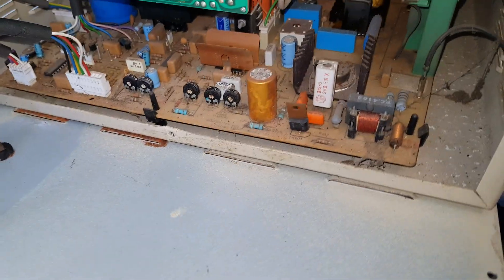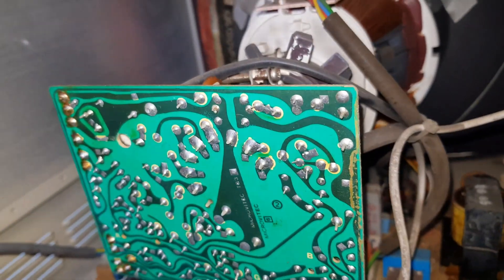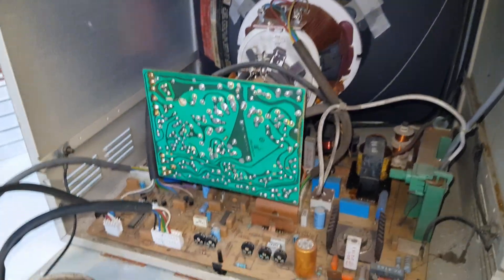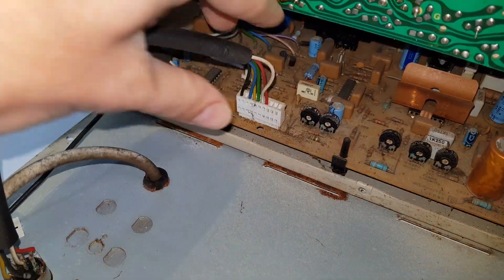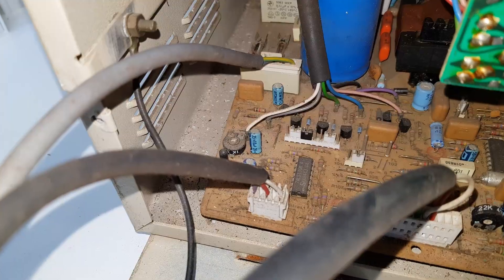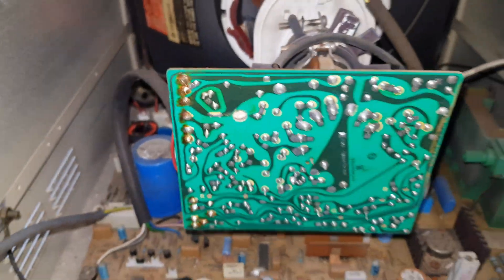There are a couple of chips on the board that can fail, and dampness and static electricity are their number one biggest killers. Before we go and spend any money on new capacitors and various other bits and pieces, I think the next thing to do is obviously remove the top, get a good look, clean it as much as possible, remove the connectors and push them back in again - that often rekeys them and gets a nice connection. Very difficult to see what's going on without cleaning this up.